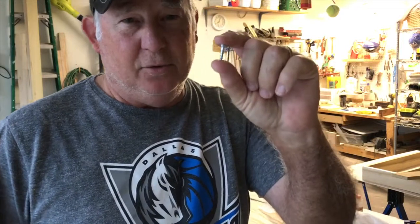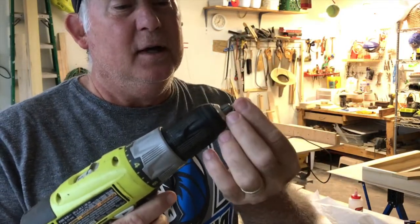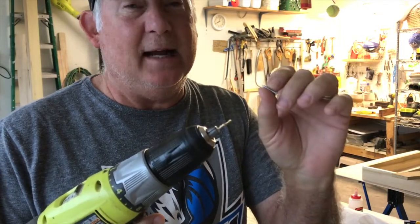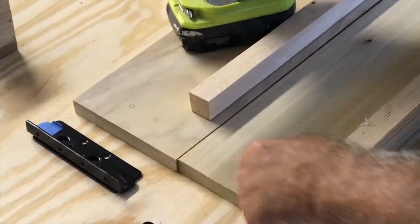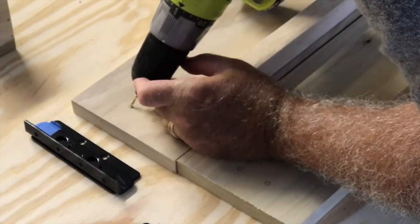So since I have a 3/4 inch depth on my rails, I have a 5/8 inch screw. So I've set my drill bit, fortunately it's short enough, and so it'll bottom out before it gets to the 5/8, which is exactly what I want. So let's drill the pilot holes. Now for some pilot hole screws, we have these marked. So we're going to drill these here.